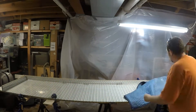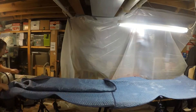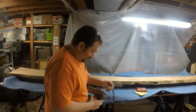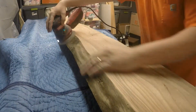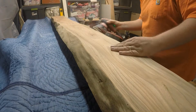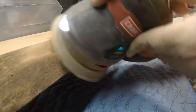Hey YouTube, Shuffles here again and we're working on the live edge epoxy desk — this is episode three in the series. Last episode I worked on leveling the table and completely covered it with the seam tape. Now to protect that, I'm laying down some moving blankets to protect it from getting damaged while I start the same process, using a random orbit sander with some 220.